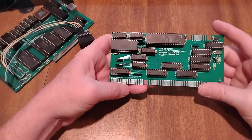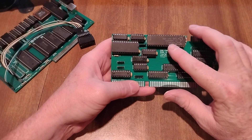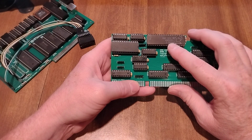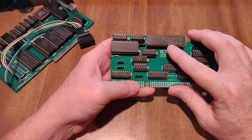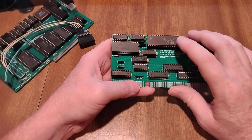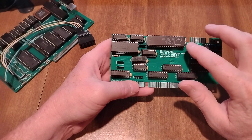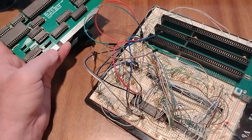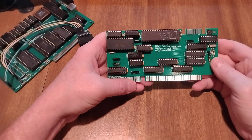Talking through the card, we've got our processor, and once again this is in fact an 8086, not a V30. That's important because the way the V30 is designed, it runs a lot more stable and can run at a lower voltage than this particular 8086. So sometimes you get a false positive on the system working with a V30, but it won't work with an 8086. This board would not work with the 8086, and I think it just had to do with stability of a bunch of wires everywhere.